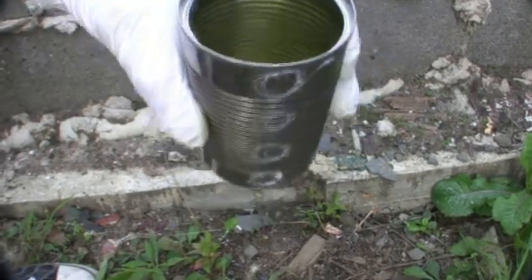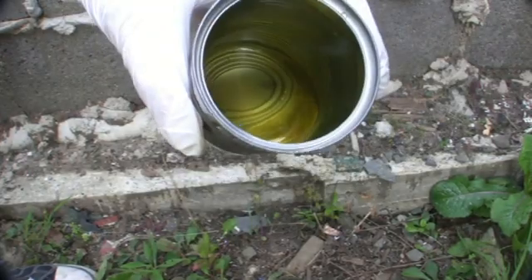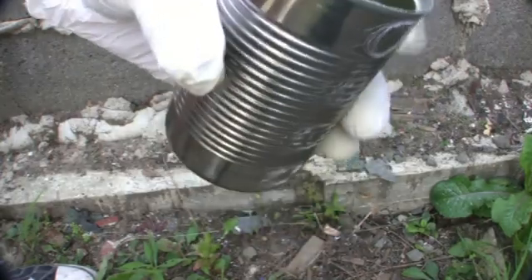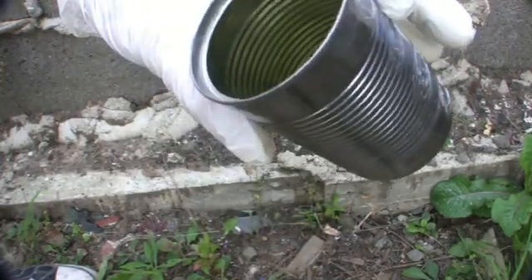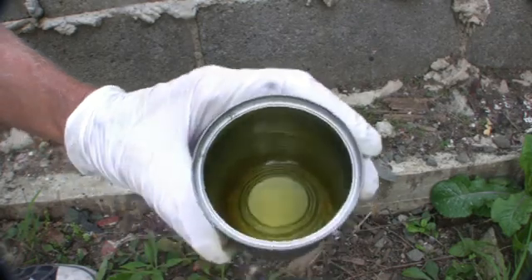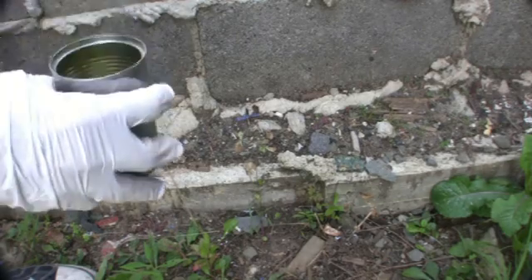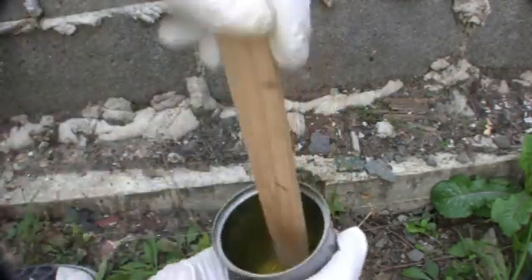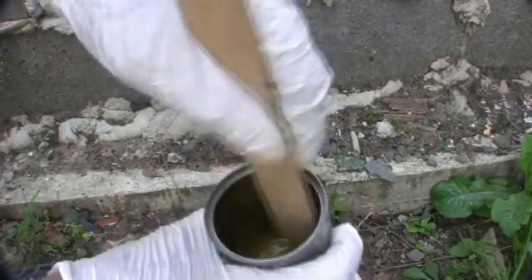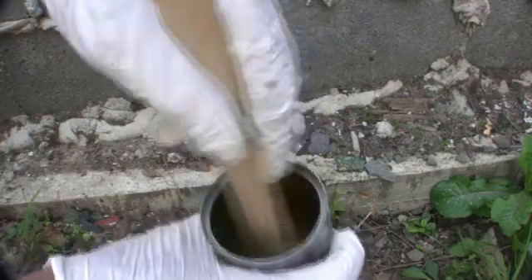Alright, it's me again. This is how I mixed it - in a soup can. These are plastic cups, they're just as good, but if you like soup these are good too. You just got to make sure you have all the contaminants and water out, dry it up before you use them. First we're going to mix it with the paint stick. This is Systems Three epoxy, which means two parts resin and one part hardener - that's the brand name, Systems Three.